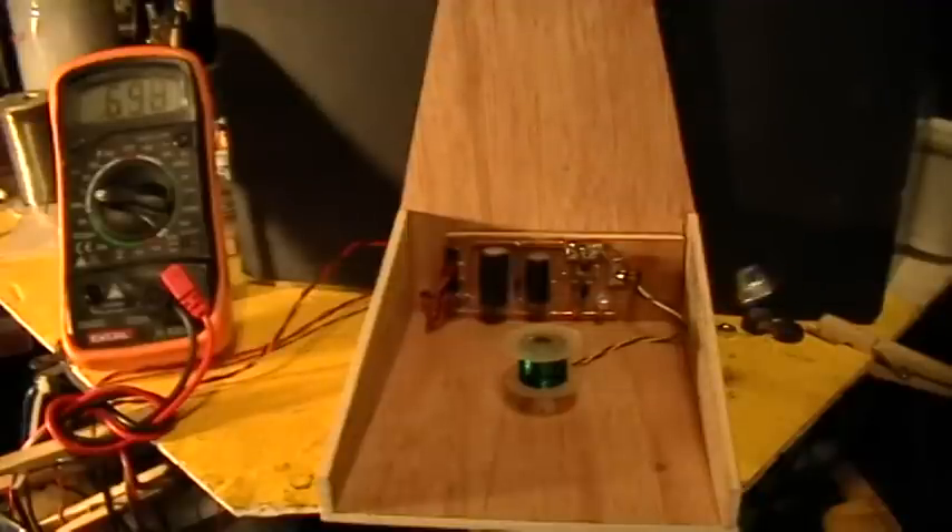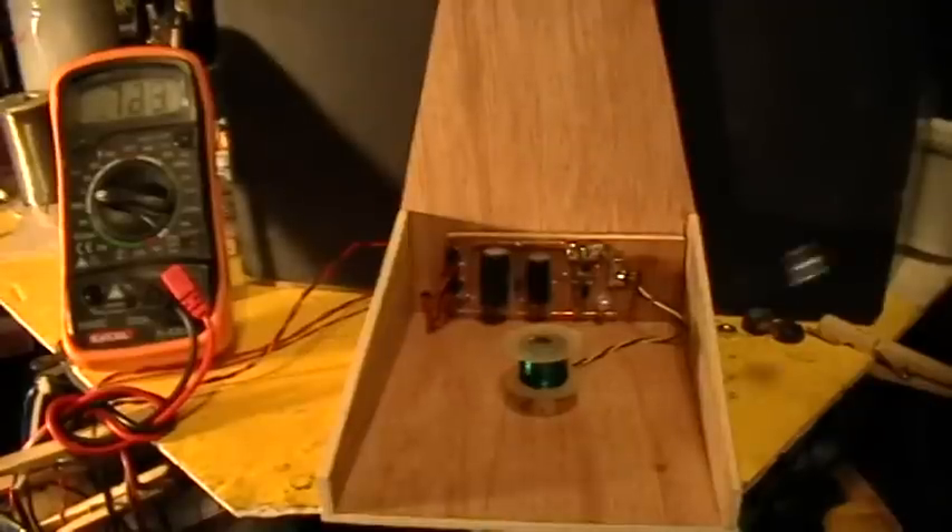It's a great little toy. I'm really impressed with the performance. The change to the Schottky diode made it start at a much lower voltage. With the 1N914 or 4148 in there, it wouldn't start until the voltage was about 1.1 volts. And here it started quite a bit below that.